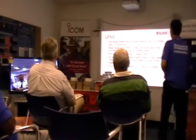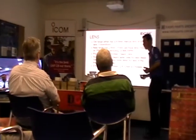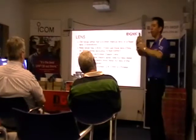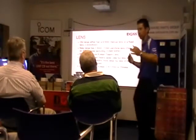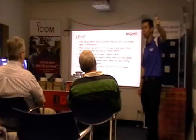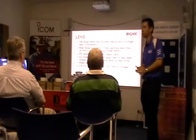So the idea of having a varifocal lens compared to a fixed lens is a situation where you might want to look at a cashier's, for example, or you might want to pull it back. You just have that range you can change a bit, whereas with fixed lenses, you want to sit on that cashier's office and that's all you want to see. So you'd have to put the camera in an angle or a spot where it's simply going to be seeing everything your customer wants to see.